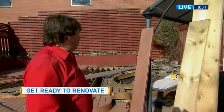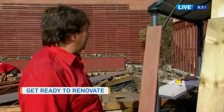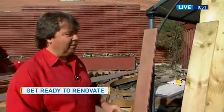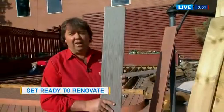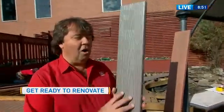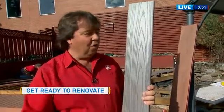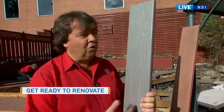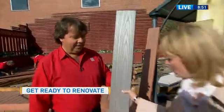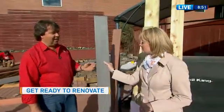What we've chosen for here, we're going to repurpose. We're getting rid of the pond here, and we're going to redeck it all. We've gone to a solid PVC, which is very light. It's an AZEK product, which is almost no maintenance. Every second year, maybe power wash it. You'll have no mold, no moisture problems, no cracking, no splitting. It's incredibly light, so for people that want to do stuff on their own, this is easy to work with.